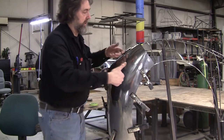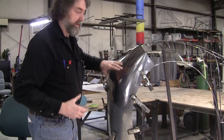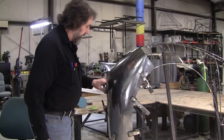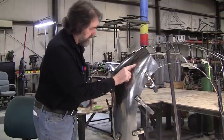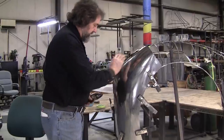And then we're going to put it in the wheel and we're going to pull it down like this, which gives you a nice little fulcrum effect, and that'll cause that to want to go this way. So we got to unclamp it and we'll roll it out. Now just mark it here, and I'll mark it here with just oil on my finger. Plus I can visually see it.